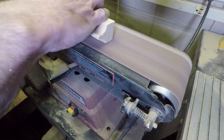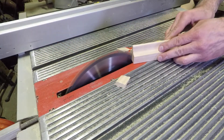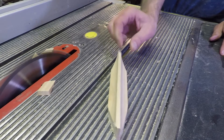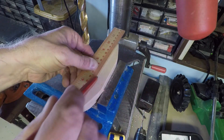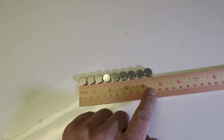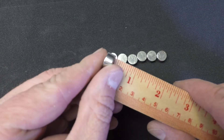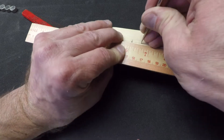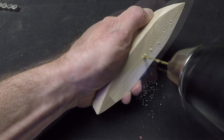Both ends are now sanded to what appears to be symmetrical by my eye. I want to bring both ends to a point — you can complete this step on a bandsaw or, if you're very careful, a table saw. On the bottom, where I'll soon be drilling the holes for the nine magnets, I need to run a line down the center. The overall length of the magnets is four and a half inches. The magnets I'm using are rare earth magnets — one half inch in diameter, one quarter inch thick. I'm center-punching holes one half inch apart and drilling small pilot holes so that when I use my half-inch drill bit they should be right on center.